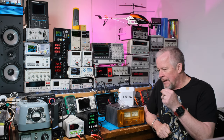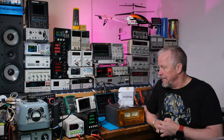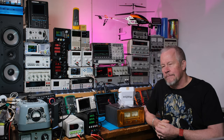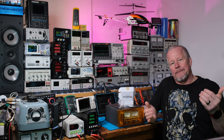I think they stopped making the OPA 2604 not because it's a bad part, but because those high voltage rails let you put out a lot of power, and with two op amps in one package it can overheat — that's why I put heat sinks on them. The OPA 604 singles are still available, and there are adapter boards that combine two op amps, though I don't think there's one for the 2604 specifically — I might make one of those.